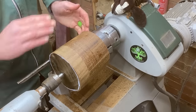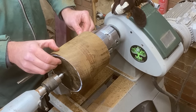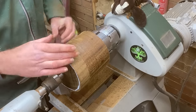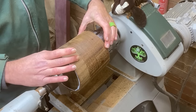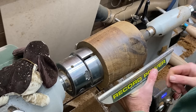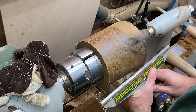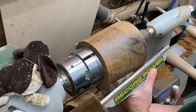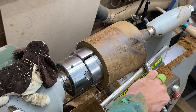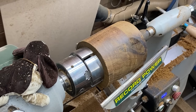Okay, we've got this turned round. The initial thought is it's quite big, quite long for a mallet, so we may want to be coming up about this far, but I'll make that judgment a little bit later on. Now I'm going to start shaping it. Mallets are generally wider at the top than further down — it's at a slight angle, not flat all the way across. The easiest way to do it is rather than having the tool rest parallel to the piece, I'm just going to turn it in at the same kind of angle I want the mallet to be, and then run the tool across keeping it in the same position — that will slowly recreate that angle on the piece. That's the theory anyway.